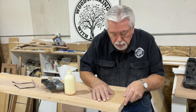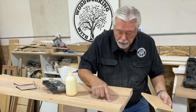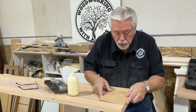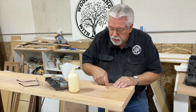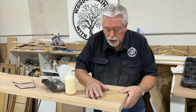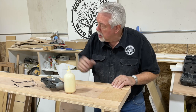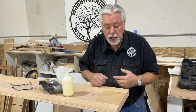That fits in just perfect right there, just like that. We're going to glue and nail that in. It covers our nails and staples that we nailed our box together with, and it creates a real nice little bevel detail on the inside of our style and rail to give our panel a real nice fancy look. We're going to glue and nail that in again with our 23 gauge, top and bottom, and our panel is ready to be sanded out.